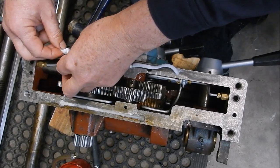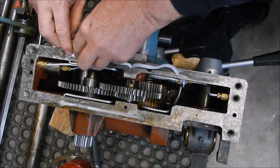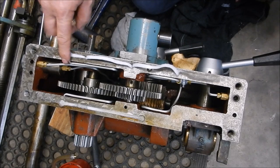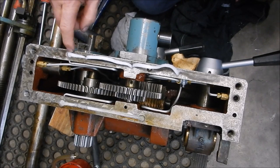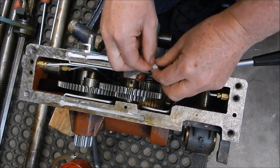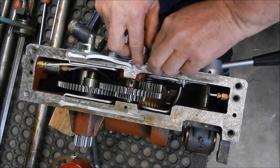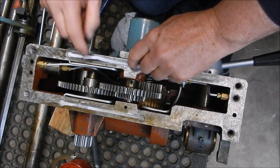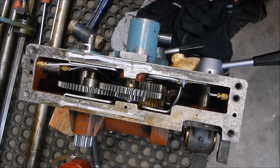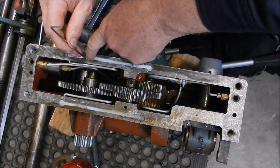I need to pack these reasonably tight in here because I want to allow a little bit of back pressure on that feed system. I'll get that jammed in there. We don't want this being free flowing in there at all — we want it to have some back pressure against it, otherwise when the pump's running it's going to take the easiest course and that will be through there. I've packed it out a little bit; this one on the end has got nothing so it's not as critical. I'll ball that up as best we can, fitting down inside there. I'll just feed these in just a touch more to get a little bit tighter.